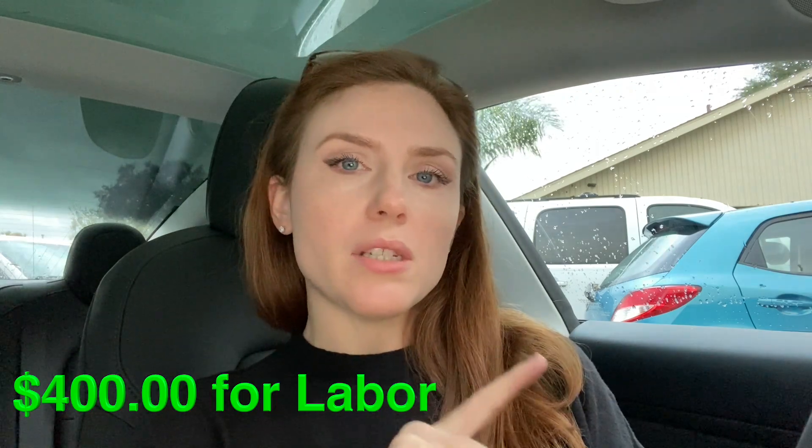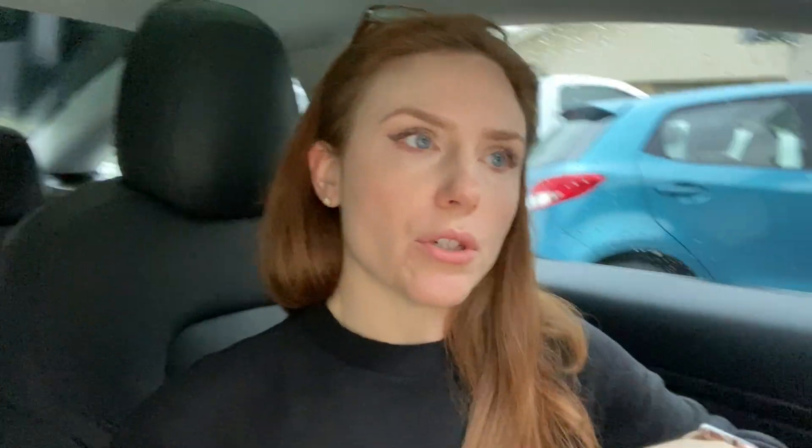I have this amazing neighbor across the street — he's a retired electrician and him and his wife are like family to us. I told him everything about the car before I got it and how much an electrician was going to charge me to take that outlet and extend the wire through the attic down to the pillar. We basically just disconnected that outlet behind the dryer, added more 10 gauge wire to it, and extended it up through the attic across the garage to the front of the garage right here.